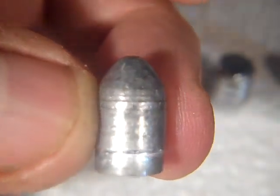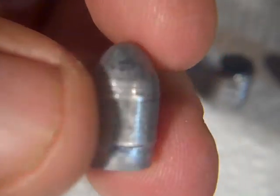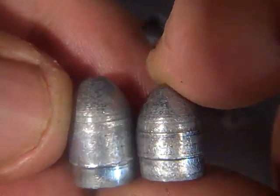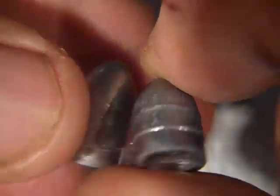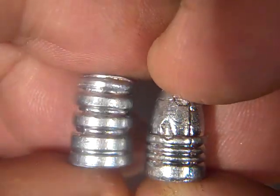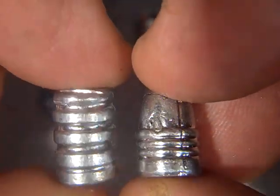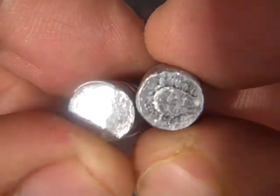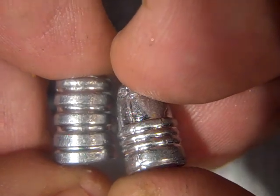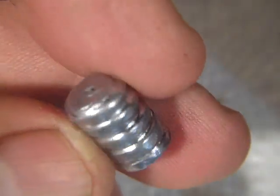That's 150 grain. I made a few 150 grains and a few 120 grains, so these are the two sizes out of the same swaging die. Now, I started with molded bullets. This is a 9mm — these are rejects because they didn't mold well. This is a 0.356 diameter, 120 to 122 grain. And this is a 38 special wad cutter, 150 grain. So these are what I used for cores.